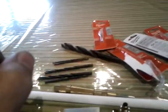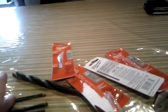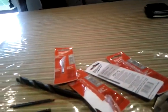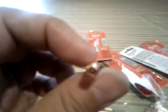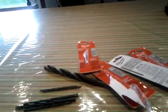There are a few tools needed. We have some sorted sizes of drill bits from very small up to three and a half millimeters, or SAE close equivalents. For the copper tip you'll want to start with very small bits because it's really tough to remove all that material in one shot. It's easier if you start with a very small bit and work up in incremental sizes to the size you need.